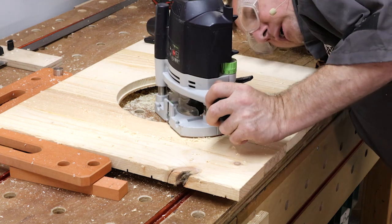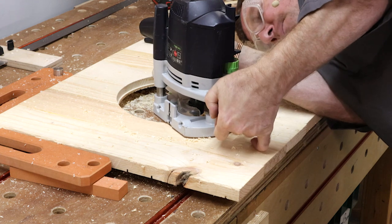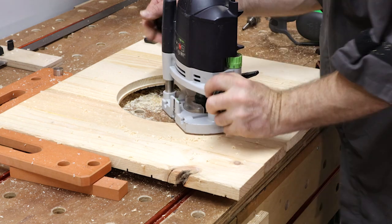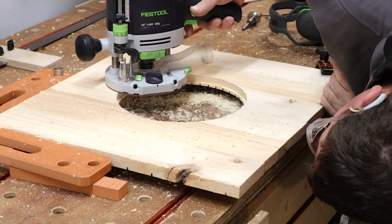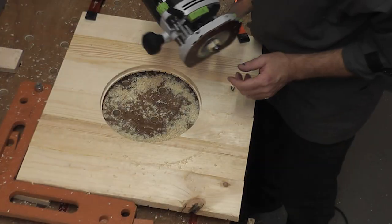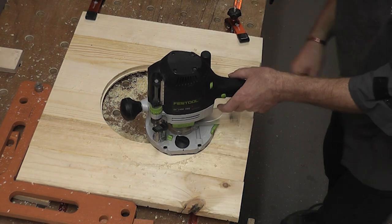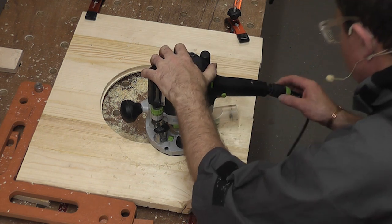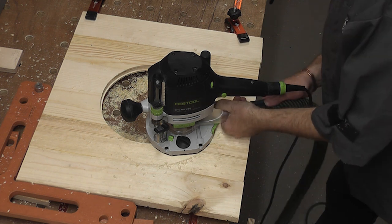Now, I just need to see where we are on there. I can come up a little bit. What am I looking at? Checking the bearing is hitting the lower recess further down. Very difficult to show you on the camera. So the bearing's got to hit that bit, the bit we haven't cut yet. We brought it up. We know our depth is the same. We haven't changed the cutter depth. Jump all the hoses. Hold the router so it doesn't fall over. To there. Hose back on.